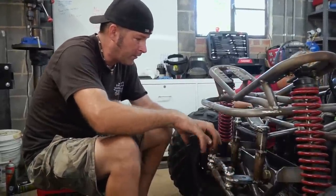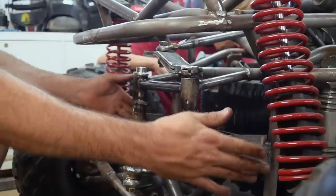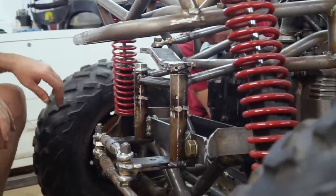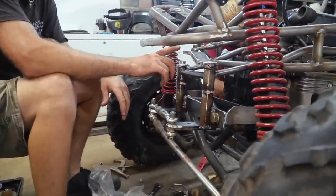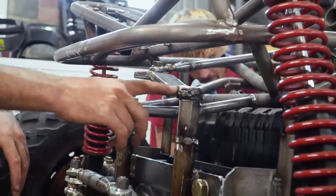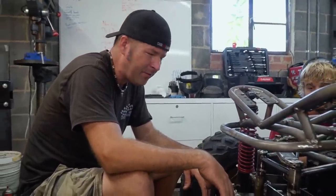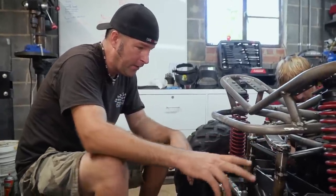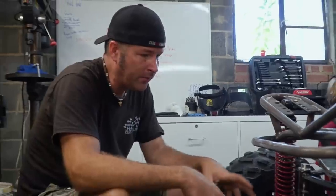What we've done on the steering: we've put a brace in here, here, here, here, and here. I think I've covered everything to support this whole system. I've added a double brace — I stacked some quarter-inch plate, so that's like half-inch metal there. Half inch here, and then just under half inch on this one. So just beefing everything up. Strong like bull.